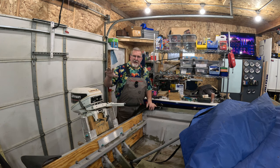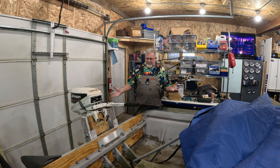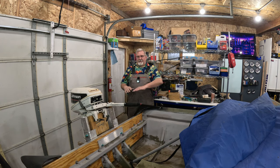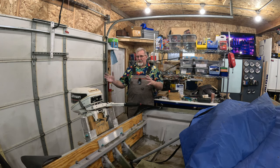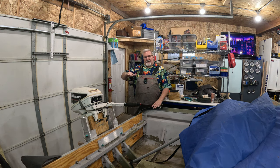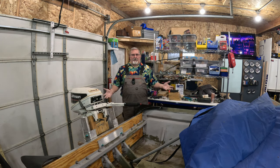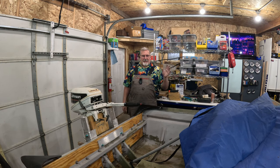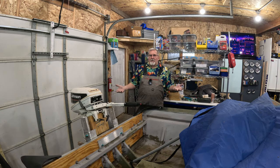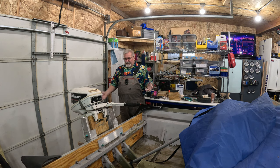All the on and off of the outboards are going to abuse this and not the transom itself by clamping multiple different things onto it. The other advantage is the adjustable ones are perfect if you're going to put an outboard on and you want to get optimal performance and get that cavitation plate where it wants, so you can go through as shallow water as you want. Go for it. It's not always necessary. If you just have a regular fishing boat, a jack plate might gain you 1 or 2 or 3 more miles an hour because of optimizing where it's at in the water.